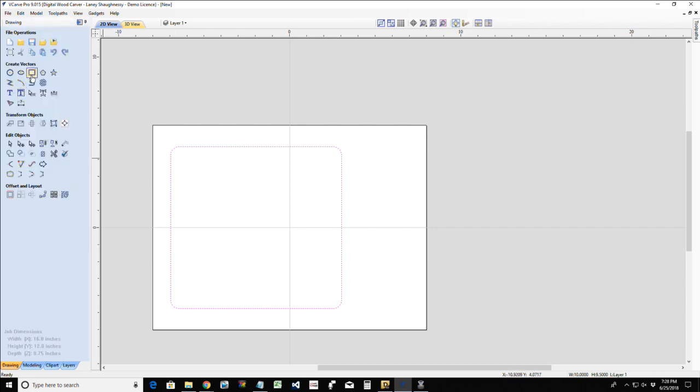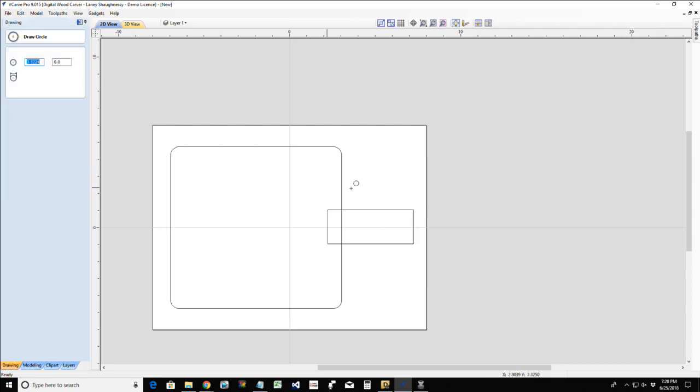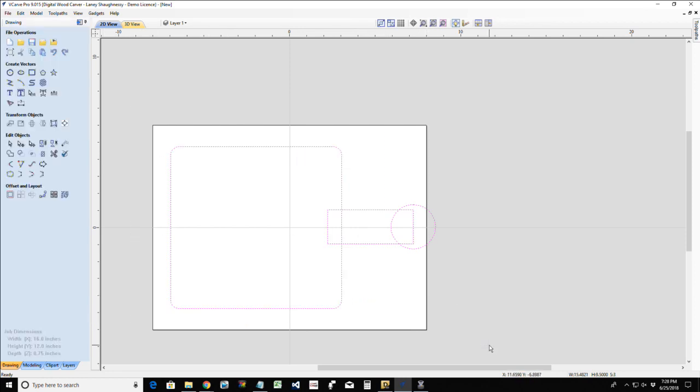And from the center point, let's get the handle out. I'm drawing another rectangle that's going to have square corners because we're going to end up cutting it off. And then let's get our end part of our handle. I'm going to end up sizing this after I get it in position. All right, first thing, we don't want a stiff rectangular handle. We want something that'll give us a nice grip, but we want this rectangle to transition, with a nice arc, into our corner. We're going to do that with the fillet tool after we get everything trimmed together.